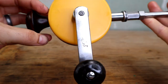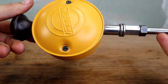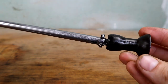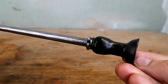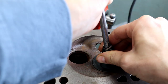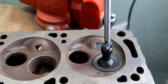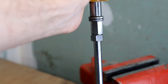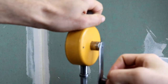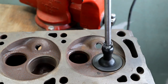This restoration took 10 hours to complete and my favorite part was learning how the gear mechanism worked. Now I'm still working on the shop, so I don't have any cars in here, but I want to set up a mock demonstration for how to use this grinder on an intake valve. Start by applying some lapping compound to the valve, secure the rubber vacuum cup to the top of the valve, then turn the crank — the grinder will automatically turn the valve in a fire-starting motion. When the compound breaks down and the sound changes, pick up the valve and turn it about a quarter to a half turn to allow unused compound to flow back into the seating surface and introduce grit to different areas.